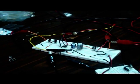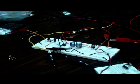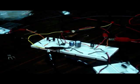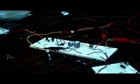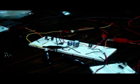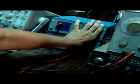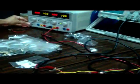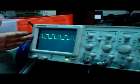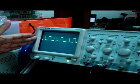As a part of demonstration, first of all we are inputting a single tone sine wave to see its modulation and transmission. First of all we are biasing the µA741. Then this is our 9 volt biasing. Then we inputted a 3 kHz sine wave.